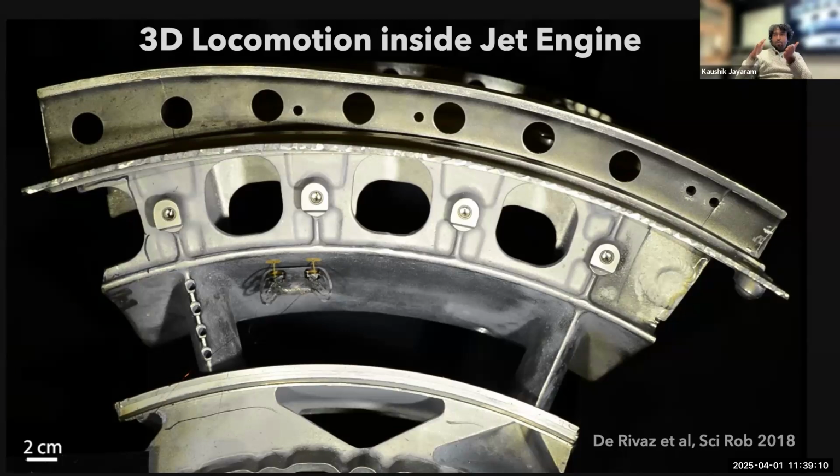And on the bottom side of the foot, which makes contact with the ground, we have a really thin dielectric membrane. In this study, we had about 12 micron thick, but in the lab currently, we are working with membranes which are about 3 or 4 microns. Basically, if you apply voltage across this dielectric film, you have electrostatic forces of attraction, which pull you into the surface. That's the principle.